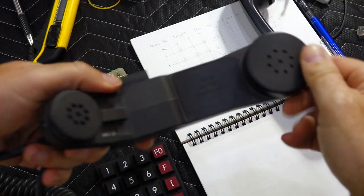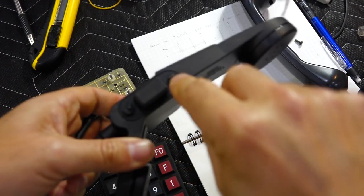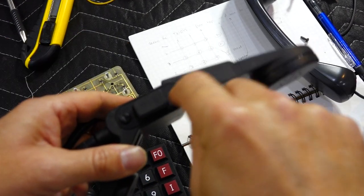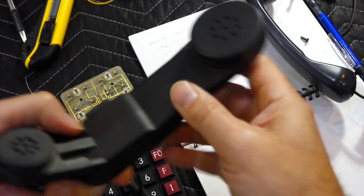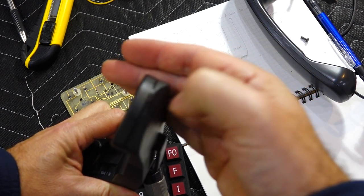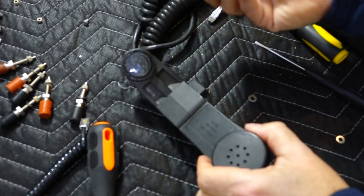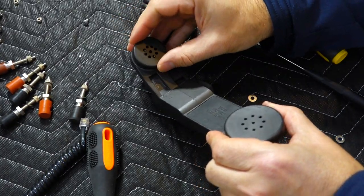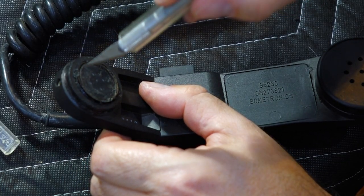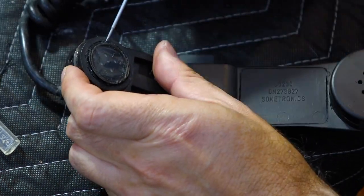On to the next riddle — the handset. I have to find what kind of transducers are used, and there is a mystery push-to-talk button protected by security screws. You cannot screw them out. We'll have to slot it further to take the push-to-talk switch. It looks like this has been worked on before and glued. I went around with the X-Acto knife, trying to prod it.